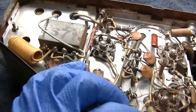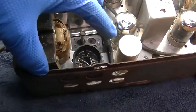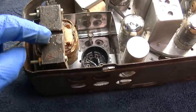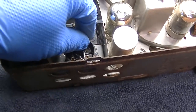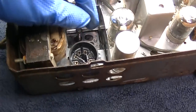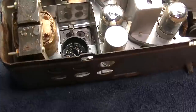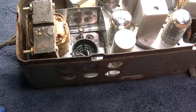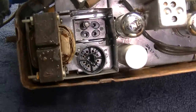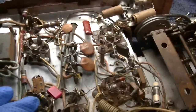The first thing I'm going to do is pull this out and recap it - there are three or four caps underneath this thing. I'm going to delete this to give us space, put the diodes on the bottom of the socket, and pull wires up through these pins so I can connect our circuit board. I'm not doing any permanent modifications that won't be able to be undone, in case we ever go back to mechanical vibrators instead of modern solid state ones.